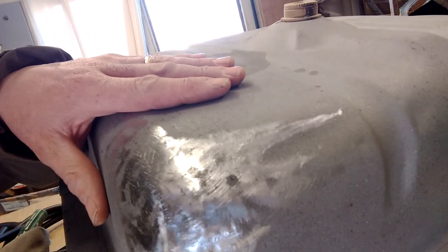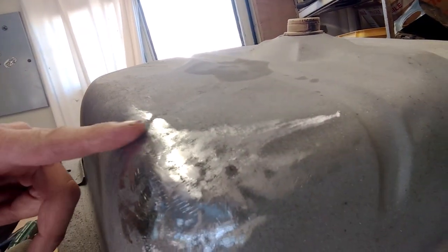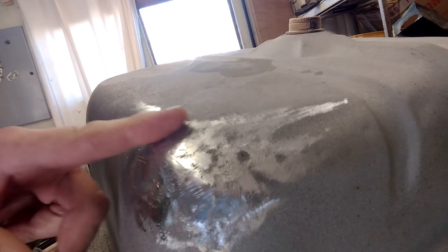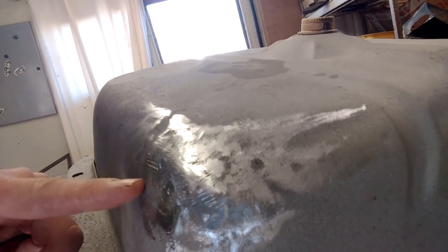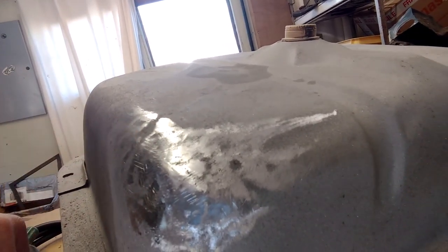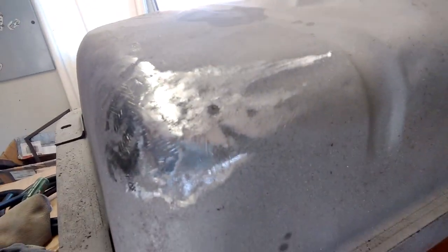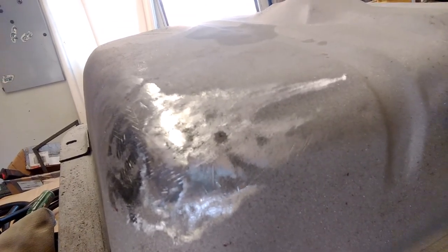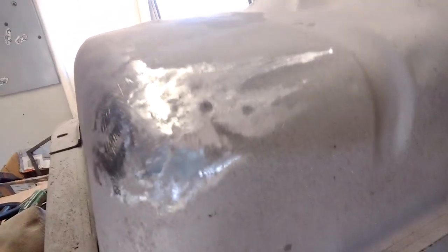As you can see, I keep just gently tapping out, then I'll turn it over and file these areas down. You can see the small dents here and a larger one along here that I just need to work at. I keep gently tapping away at it, then turning it over and filing to highlight the low points until I've got a satisfactory finish.